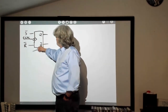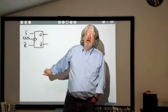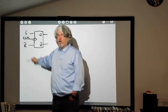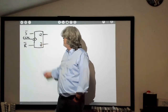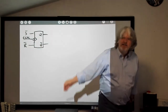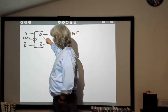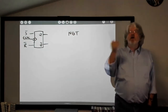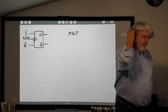In the case of this flip-flop, I've written a bar above both the set and reset signals — those must be active-low inputs. So to reset the flip-flop, I've got to take the reset line low; to set the flip-flop, I've got to take the set line low. I've written a clock input with a little arrow, but I've put a bubble in front of that clock input. That's telling you this is a clock that triggers on negative-going transitions. This flip-flop is only going to change Q and Q-bar when the clock is transitioning low.